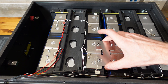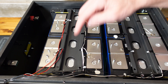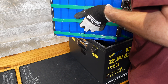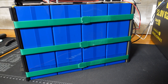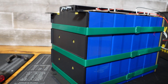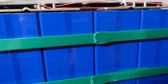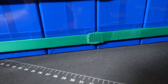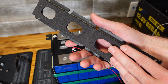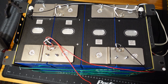Removing the two bus bars, four screws on top, and four screws holding the battery pack down to the bottom of the case — this is a very nice battery pack. These cells are pristine; look how flat they are. There's a steel plate on each end, and three plastic bands holding the steel plate and battery pack together. We have a layer of epoxy board, a foam layer, and some battery paper between each cell keeping them insulated. There is nothing on the bottom of the battery pack, though there is some epoxy board on the bottom of the case. There's foam padding on the bottom of the bracket as well. Look how perfectly flat the cells are — there is zero bloat.